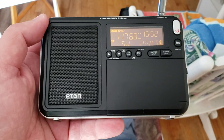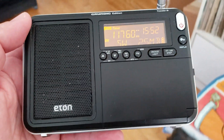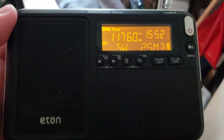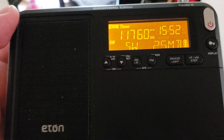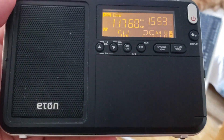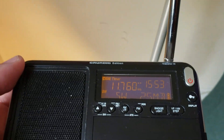So what I do is go around my home. Basically what you want to do is tune a signal or tune the AM band and go around your home. You will find spots where the signals are better, and spots where the noise level is actually stronger. Of course you don't want to be in a place where the noise level is strong — you want to try to get the stations. By going around your home you can actually listen and see where the noise is stronger and where things are better.